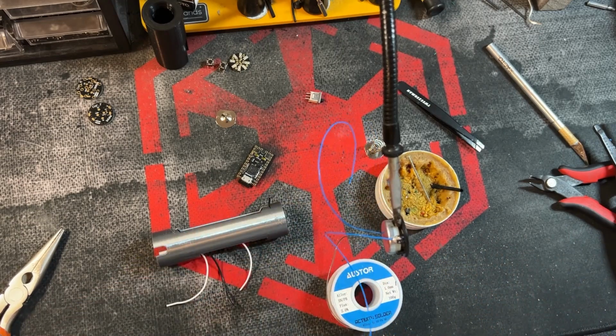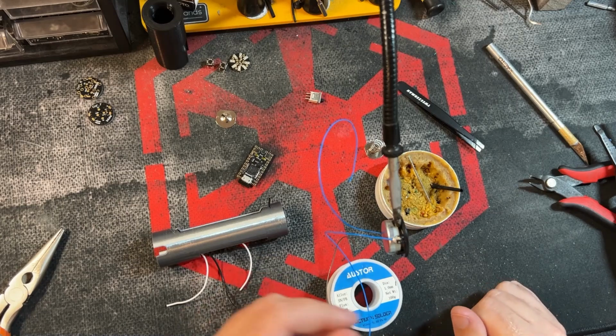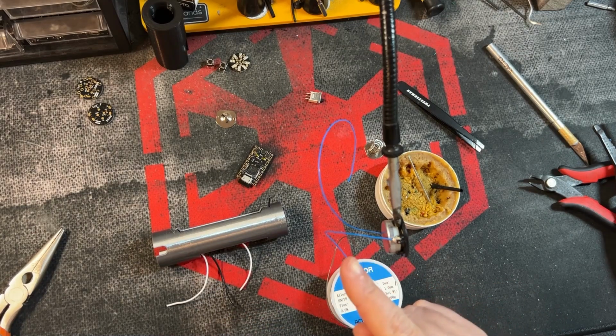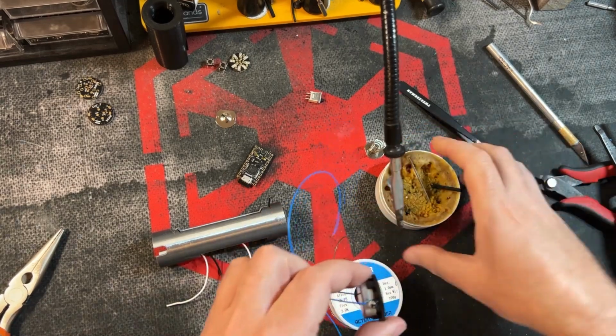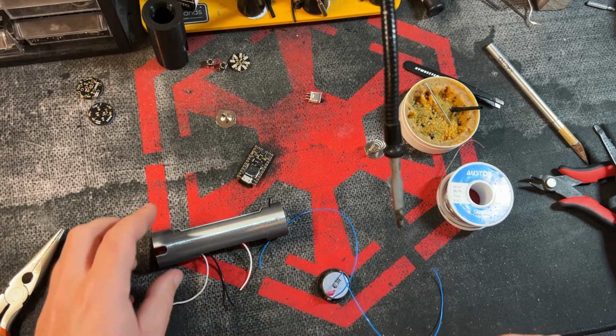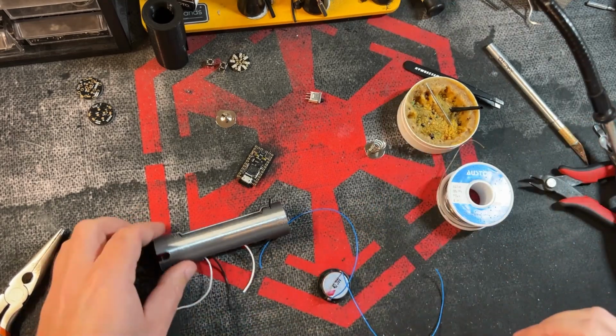What you don't want to see is the wire soldered to your pad and then extra wire sticking out that is not soldered to the pad. And by wire, I mean stripped wire. Okay, I'm going to brush that to the side now.